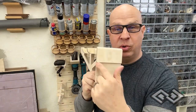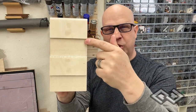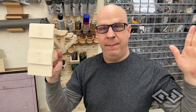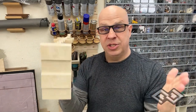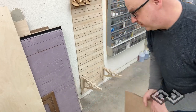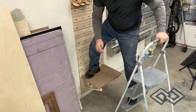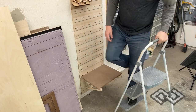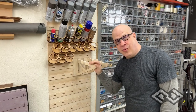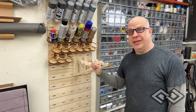Because the wall panels have multiple cleats that are all evenly spaced and very accurate, you can build holders that will transfer the load to multiple cleats. So the heavier the object is, you can make bigger holders or bigger panels to support a lot of that weight. I'm a little over six feet tall and 225 pounds. Like anything, though, physics is important — if you were to hang way out here, because it acts like a lever, you will definitely break the cleat and it will come off the wall.